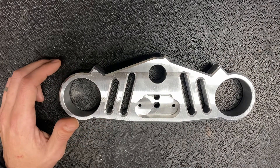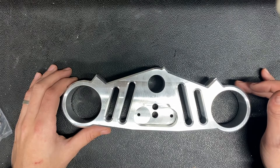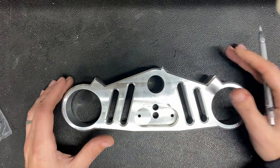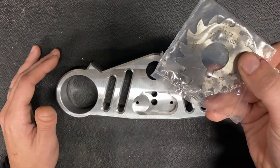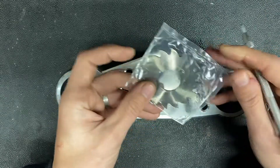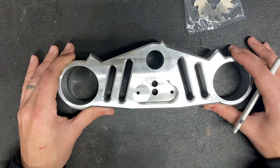After that I'm gonna come in with this slitting cutter at a 45 degree angle through the part. The challenges here are primarily inexperience on my part — I have never moved my milling head to an angle before and tried to mill on a 45 degree. I'm curious to see what kind of force it exerts on the part and if it'll remain rigid. I've also heard these slitting cutters are quite terrifying — I've never used one before. They need to run at a pretty low speed and my mill does not turn very well below 300 rpm, so that's a challenge for sure. But let's get the part into the milling vise and give it a try.